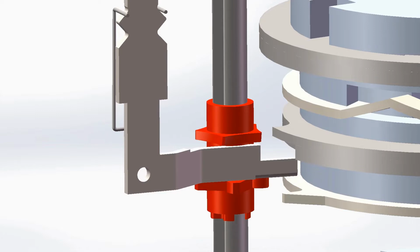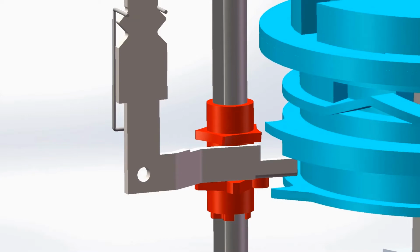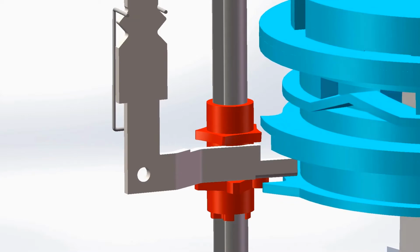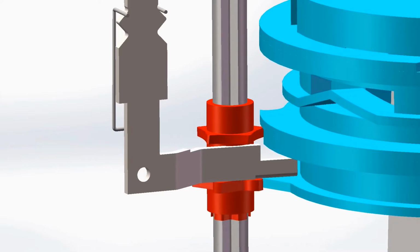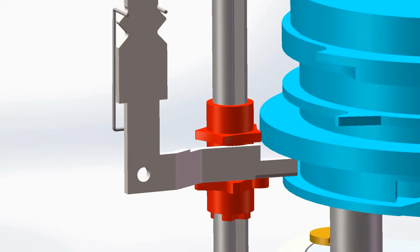When the carry lever arm pushes the assembly into the downward position, the count gear is moved into the path of the result counter carry increment disc, which is mounted to the tens bell and is driven, like the step drum, by the main shaft. There is a single tooth on this carry increment disc, which is positioned so that it follows the teeth on the step drum as the crank is turned. This tooth mates with the count gear and increments the transmission shaft to the left of the one which performed the carry once, incrementing its numeral dial and thereby effectively adding 1 to the next highest digit.